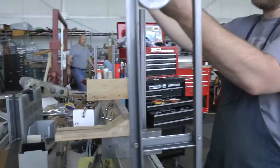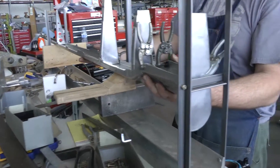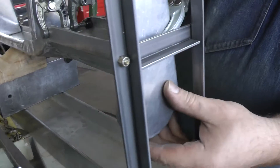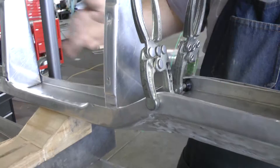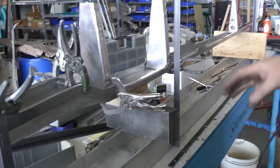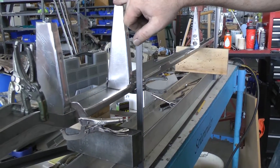I'm in the process, and it will sit in there and be held at known points. Like, this attaches to where the spar comes through — it'll catch some of the rivet holes and hold it exactly where it's supposed to be, as well as going outward. I'm trying to incorporate into the jig all the known points: hinge points for the elevator itself, hinge points for the trim tab.